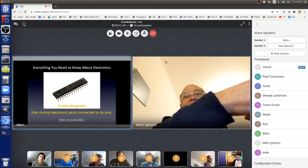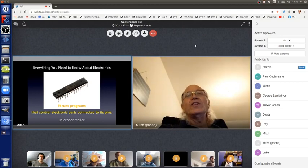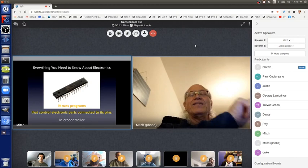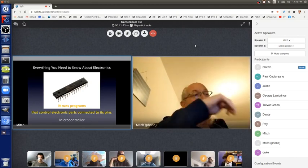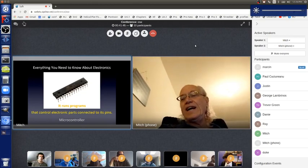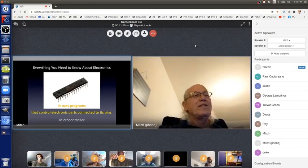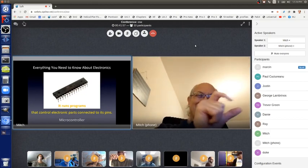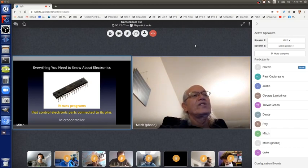You can put that in a search engine and say datasheet, and then it'll give you a datasheet with 250 pages full of information about this chip. And you can also do that for LEDs to see their various qualities if you know the part number. They're not printed on there. So when you buy an LED, it's good to make sure that you remember the part number or write it down or leave it on the bag that the LEDs are in, or a little drawer. But the chips have the number printed on it, so you can always look that up.